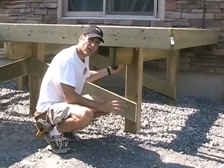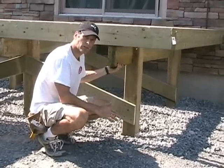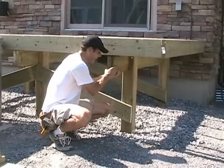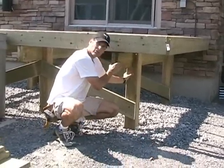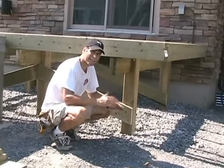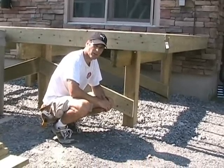It's a very, very inexpensive way to upgrade your deck and improve the strength of it, and literally render any hardware that would connect beams and posts together redundant, because the beam is sitting on top of the shoulder of the 6x6. It's a great idea — I highly recommend that you consider it in your project.